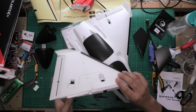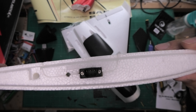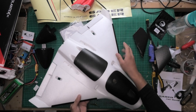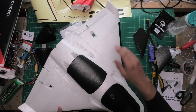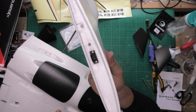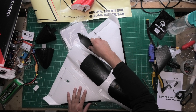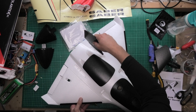I do see we have servo connectors on the side, and I do feel a little bit disappointed that ZoHD have cheaped out to the point that I can't really use these wing connectors because they've only put three pins in there. It would be a natural thing to go for maximum separation and get our video receiver on one wing and our transmitter on the other wing, but with only three pins instead of the full six, that doesn't really give us the option. The only options are to either replace them or just take them out, which is frankly what I'm going to end up doing.